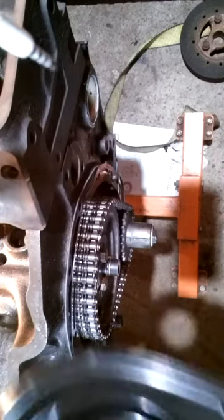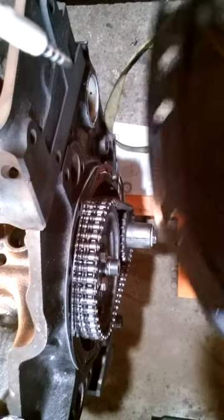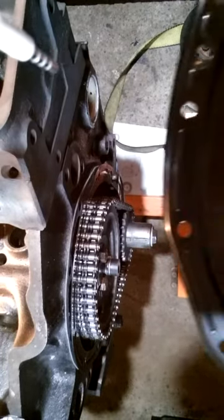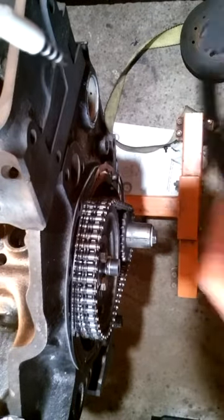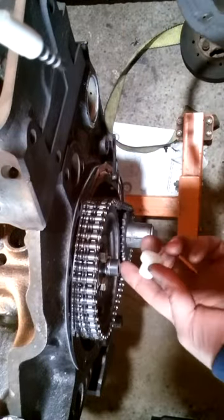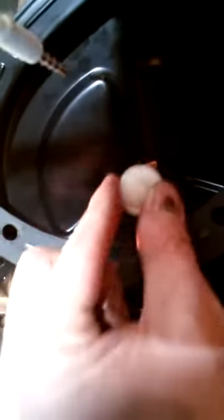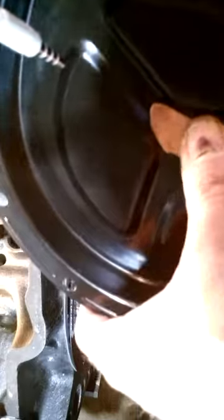This video is about how to adjust the end play in a roller camshaft after a retrofit. There's a cam button — this one is nylon, this one is metal. The metal one has a hole in the center and it presses against the cover to keep the camshaft from moving too far. The cover needs a little play — one to five thousandths is what I've been told. Some people try a little bit more, so basically you want no play but you want play.